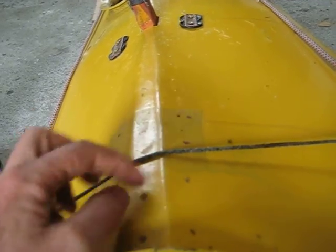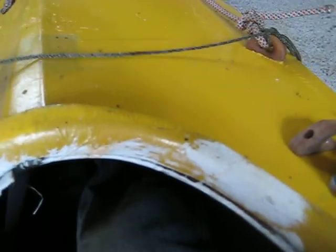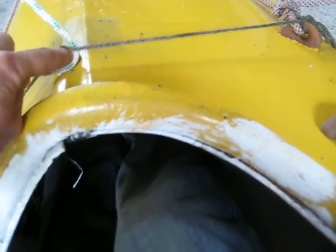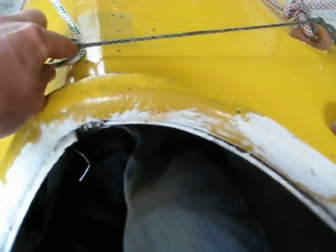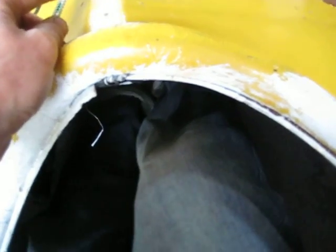If it looks promising enough I might put another hook here and here, or maybe just a central eye — a big eye that will be really easy to feed through if I'm doing a whole bunch of upwind tacking. I can just run it from there. That's probably actually the way I'd do it — just a basic central eye. I don't need to put another deck fitting on because I can just have a short traveler going from these lifeline fittings using rope, a couple of knots, and a little block.